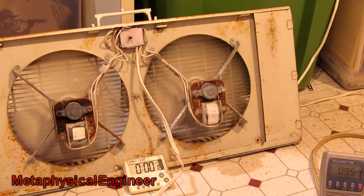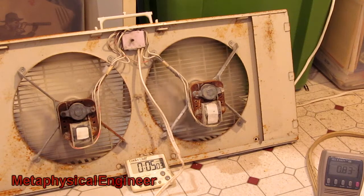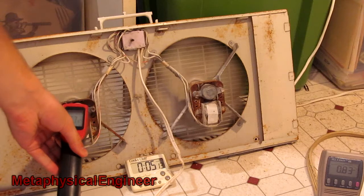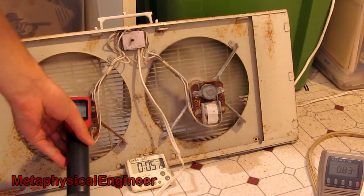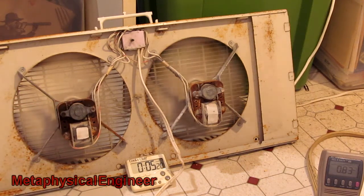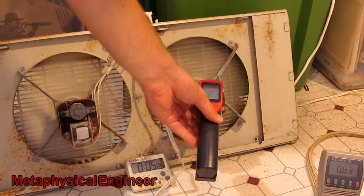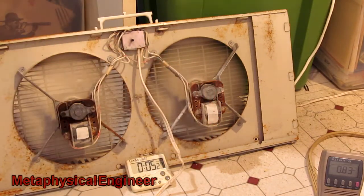A little timer will give a good indication of how long it's been running, even after I cut the camera in and out. We're about five minutes in. The current has dropped from 0.99 down to 0.83 amps and, unusually, the motor that's spinning at normal speed is getting too hot — already at 90 Celsius on the very outside of the windings.